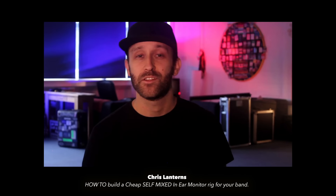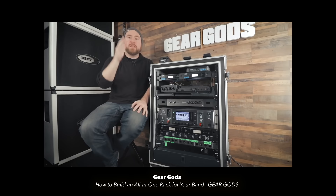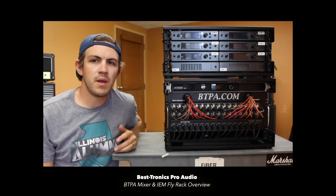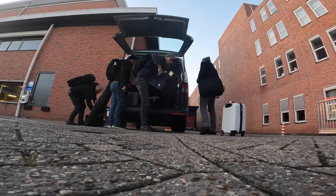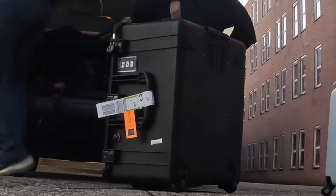Unless a venue has a dedicated monitor engineer, a front of house engineer will just be overwhelmed at soundcheck. If we can control our own mix, we can set it so it's the same mix every night, especially if we travel with our own drum mics — you turn up to a show, your mixes are saved, all you do is plug in and you're ready to play. So touring bands are electing to build in-ear monitor rigs. Since we tour in Europe often and have to fly places, this rig would have to be flyable — a very strict weight budget. The whole thing would have to be under 70 pounds and have 24 channels of audio.